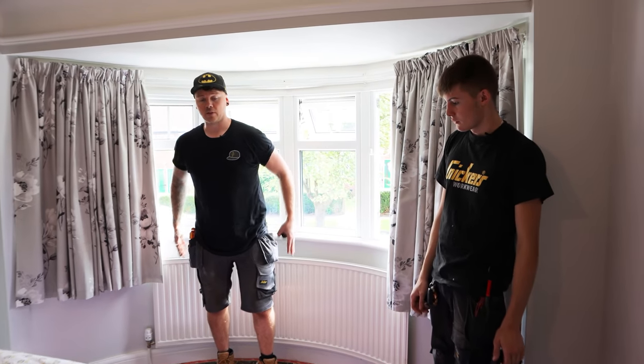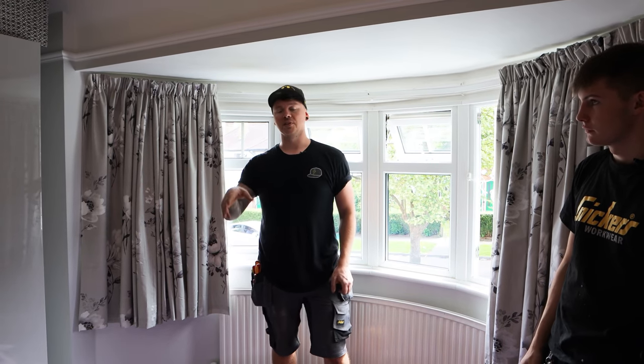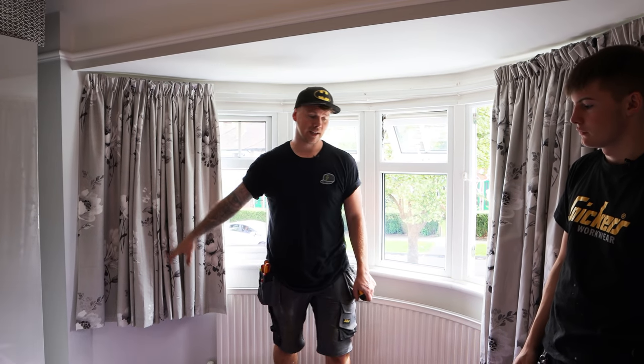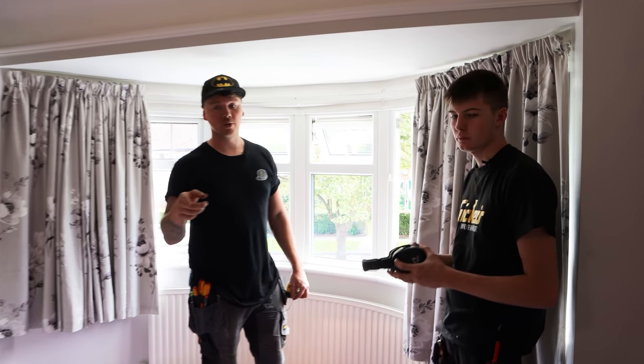And for the spotlights, we'll be able to run down the joists, so we won't have to take the entire floor up. If my measurements are right, hopefully they are, when we cut the holes in the ceiling, we should be able to rod straight to it and allow most of the floor to stay intact, hopefully. But I need to find the light switch. There is metal conduit there, so I should be able to pull it back down.